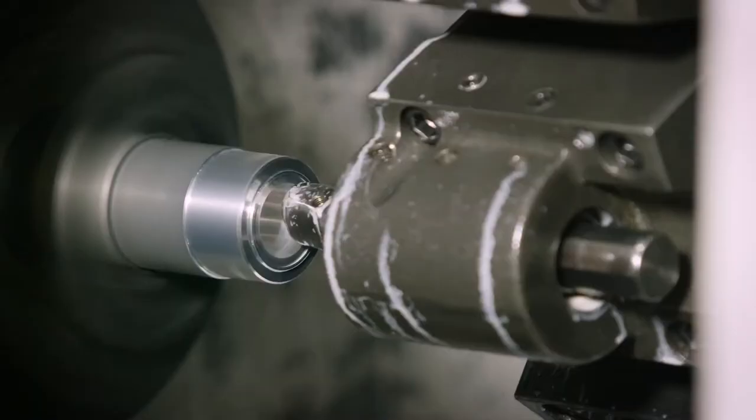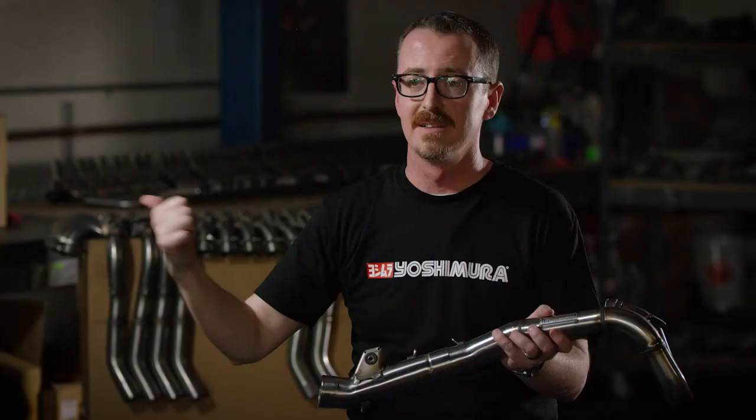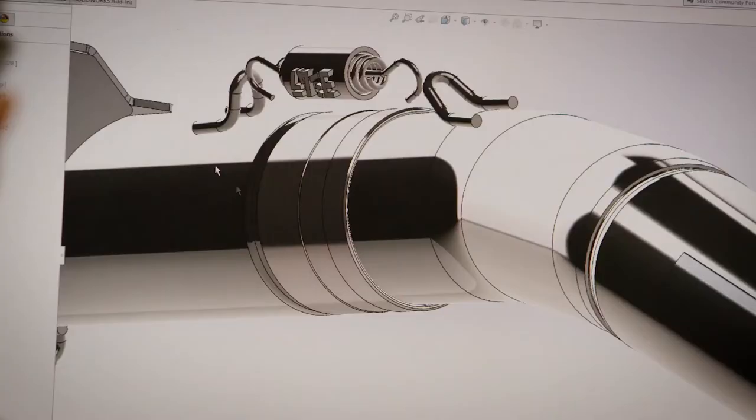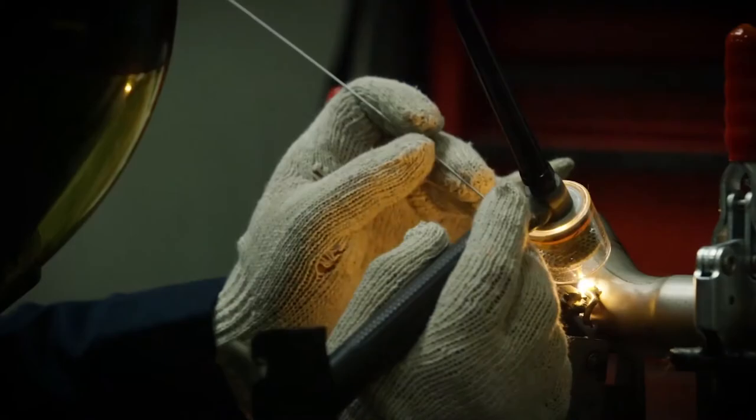This is now a fully machined joint. It's controlled by our CNC mill or our lathe, making sure that the ID is the precise size that it needs to be. That takes so much of the tolerance out of it and you're able to repeat that joint assembly every time.